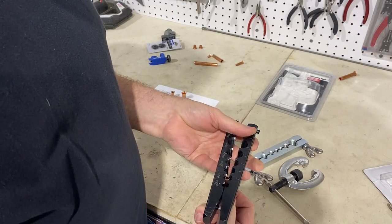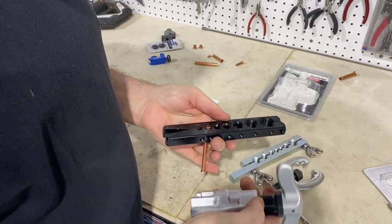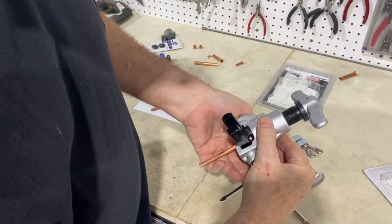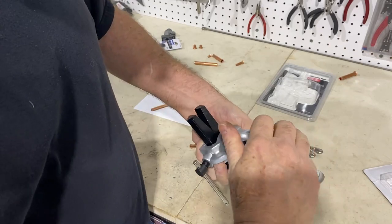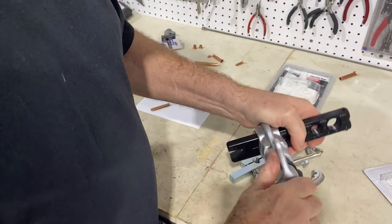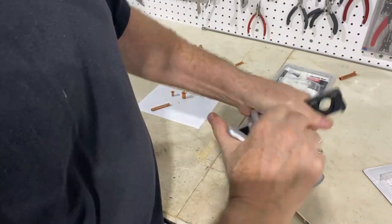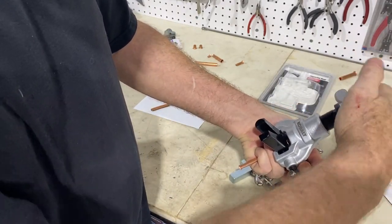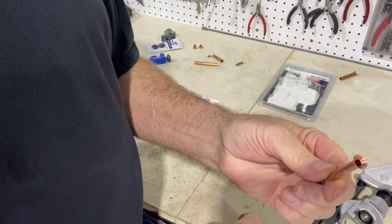Let me put it in this one — the Cobalt, into the 1/4 inch size. Sticks up about 1/8 of an inch. I'm showing you this in real time so you can see it does not take a long time to do this. Okay, snug it down — you can see the point is just inside there. There's the snap. So you just back it off now. And that's a nice flare.